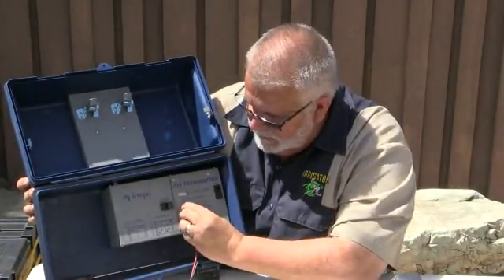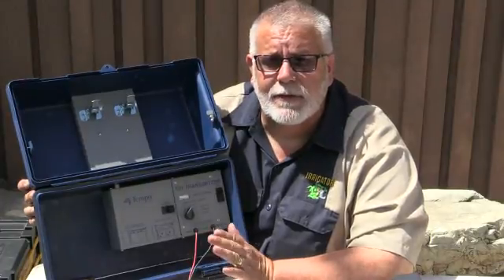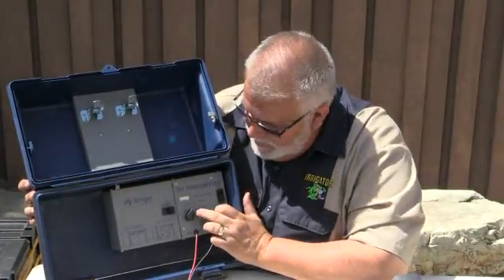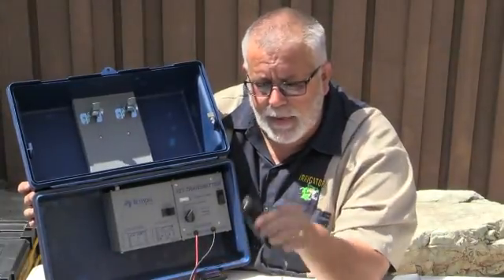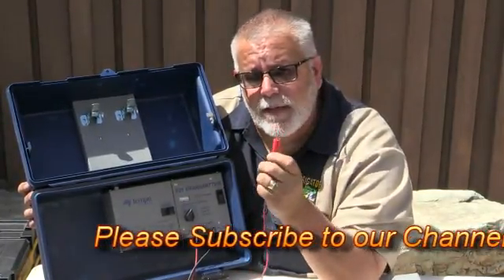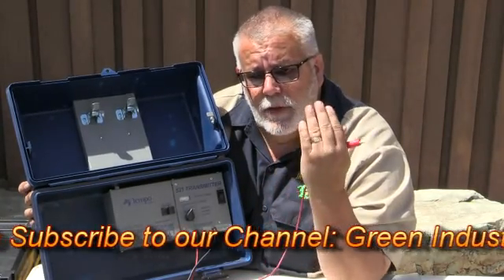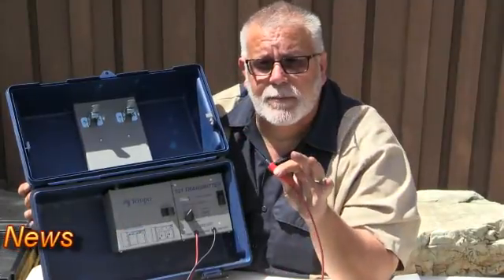So I'll flip it off. These little settings right here — one through five. I've been wire tracking since '77, so I've been doing this for quite a long time. I ground this in the field with a little screwdriver or a stake. I put the black wire on the ground, then I take the red wire and put that on the station I'm trying to wire track. If I'm at the clock, I take it off the terminal strip — unscrew the wire, take off number seven, and put this on it without letting it touch the box.